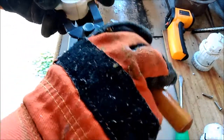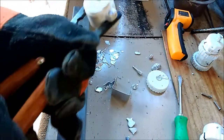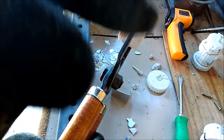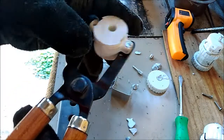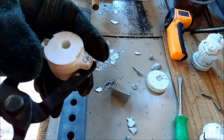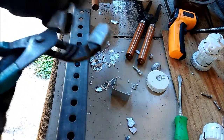I see what's going on. The reason for that gap is my pliers are not centered on the cavity — they're set at the bottom of the mold. So when I crimp down, it crimps down the bottom but the top half of the mold remains out of alignment.